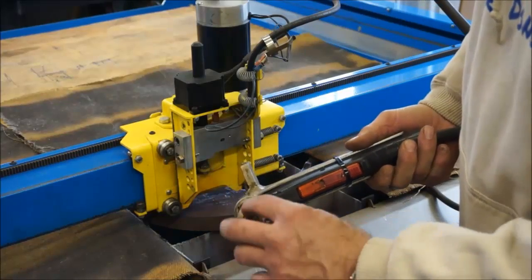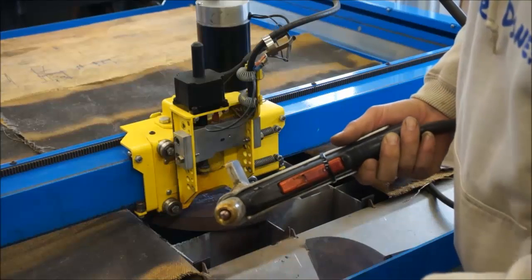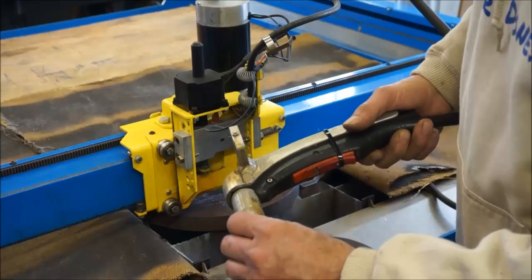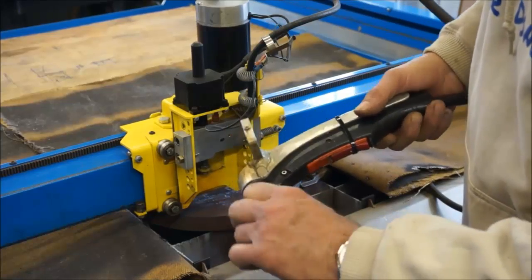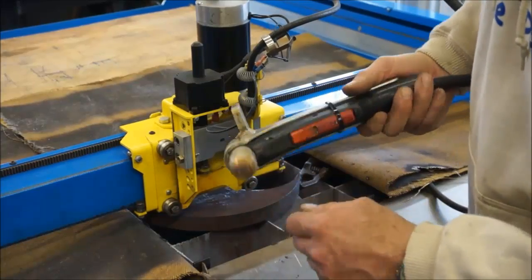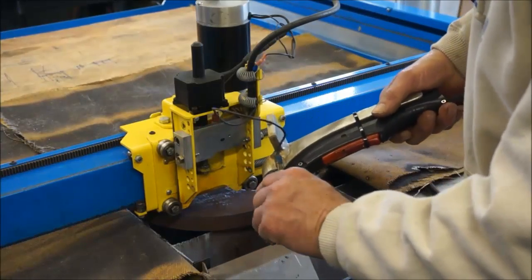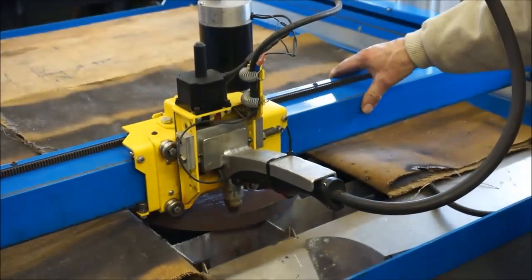And then instead of your standard open tip here, I run a machine style tip. And I've got the screw-on contactor here that screws over your nozzles itself. And that makes the contact. And then I got the current lead here. And pops right back in there like that.